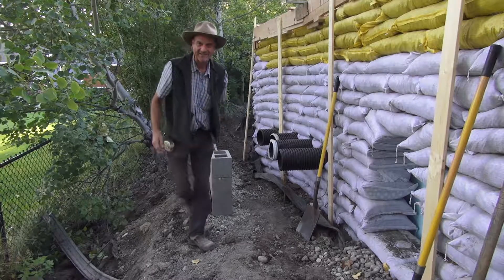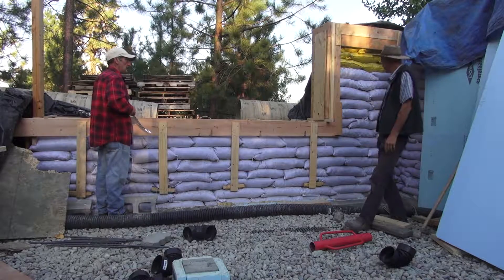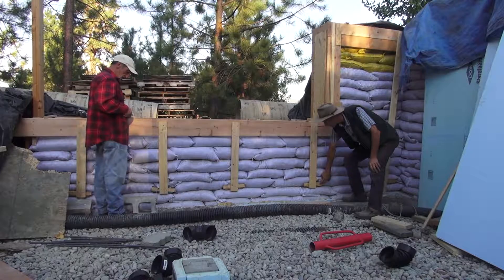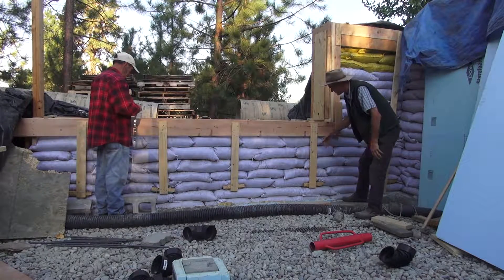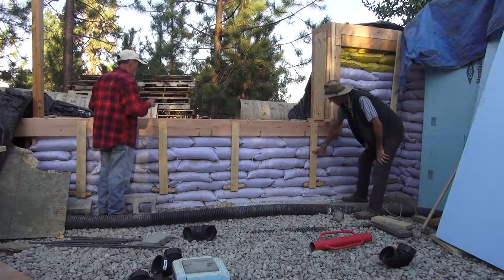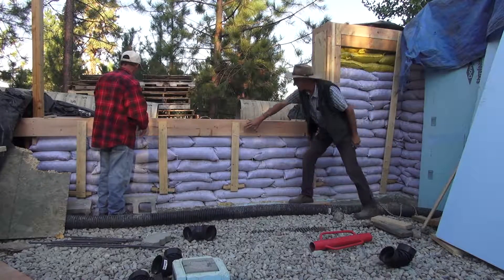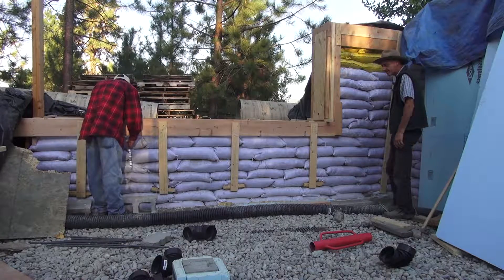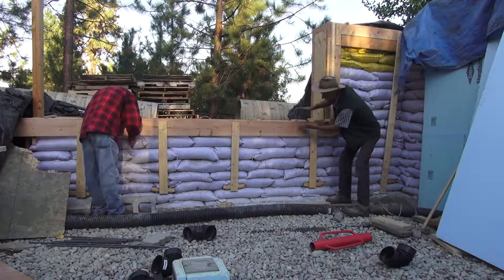This is the window on the east wall and we use these braces here, tracing down to these gussets that we put inside the bags with all the nails in them. Those are really solid in there — you can't pull those out. We supported this form on these braces, and then when the wall is higher we just use the taller brace, and that keeps the forms from moving up and down.